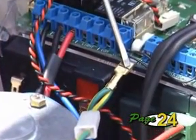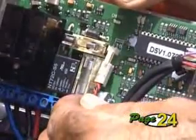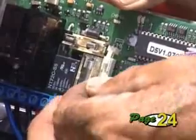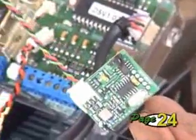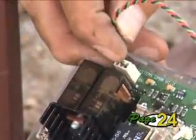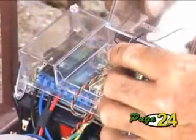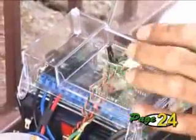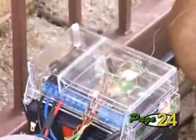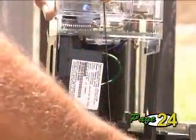The spade connector of the charger earth lead connects onto the controller here. The charger output plugs onto the controller via this white connector. The Nova plug-in receiver connects directly onto these pins on the controller and sits in the convenient receiver housing. Feed the aerial through the gap of the lid and stretch out the wire as straight as possible down towards the bottom of the gearbox. This helps give the unit better range.